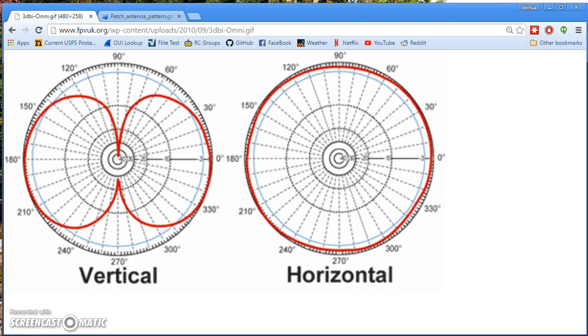The type of antenna hanging off an RC receiver is typically a quarter wave dipole. This may be closer to a half wave dipole, but they're very close to each other. In these graphs, horizontal coverage is what you see looking down on top of the antenna - like those rubber ducky antennas you might see on a Wi-Fi access point or your RC transmitter pointing straight up. The vertical coverage pattern is looking at it edge on. These are also sometimes called the azimuth and elevation.